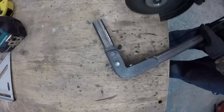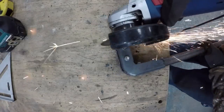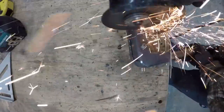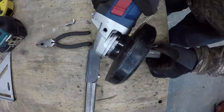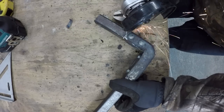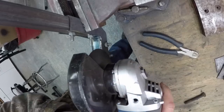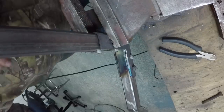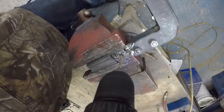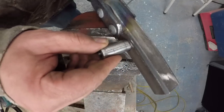The heat really helps — you can see the massaging of the metal right against the one-by-one. I'm very happy with the result. The bent-over plate will give the tool much support. Now I'm just removing the excess material and cutting the excess of that plate, creating room for eventually putting my mechanical pivot point. I'm also removing the excess of that bolt — later on it's going to be riveted.